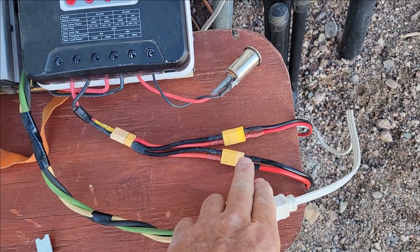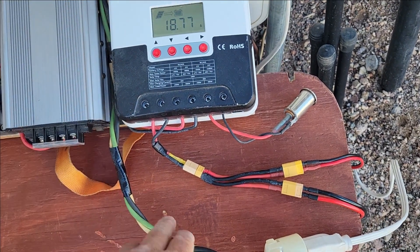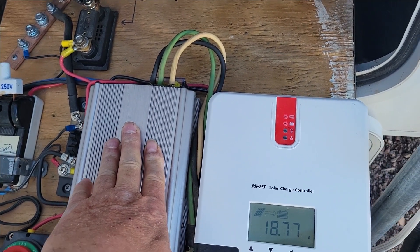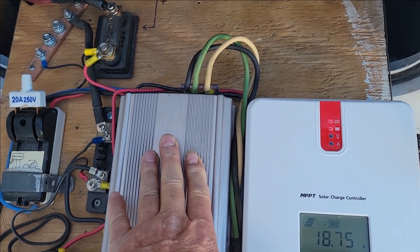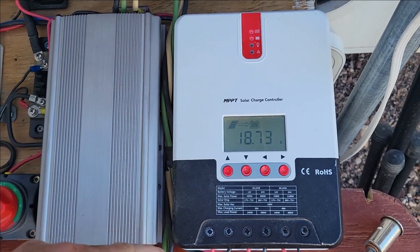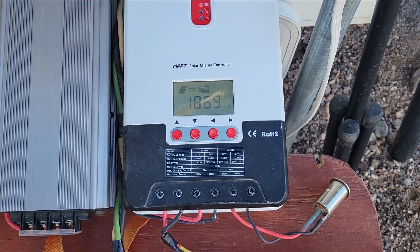I have two sets of solar panels coming in and one turbine. I'm using a regular extension cord wired into the wind charge controller because these are three-phase — there's no positive or negative — so as long as you're getting the three wires from the turbine down to your controller, you're good to go. It's AC, so the controller converts it to DC to charge my battery.